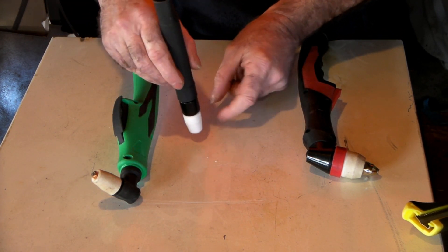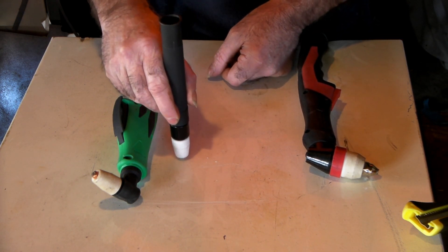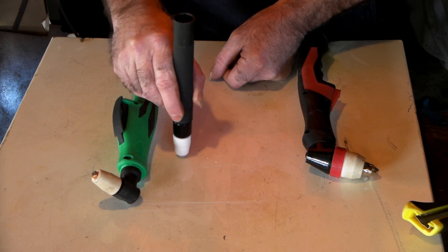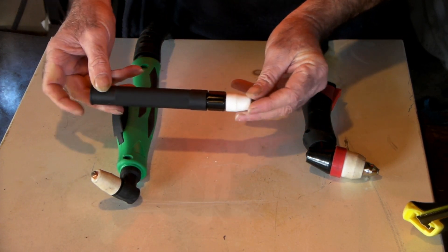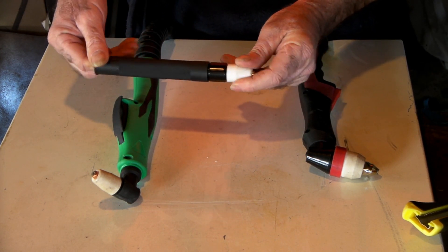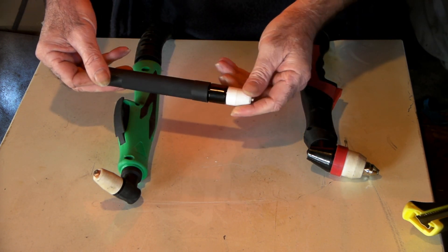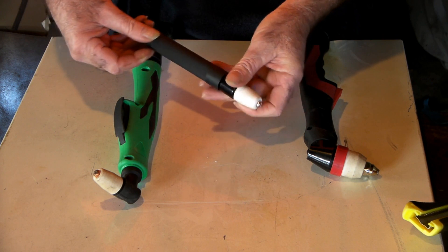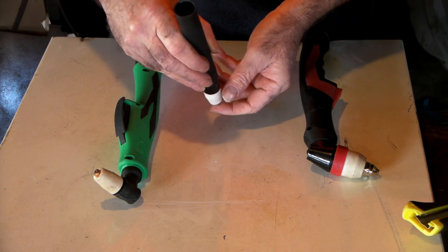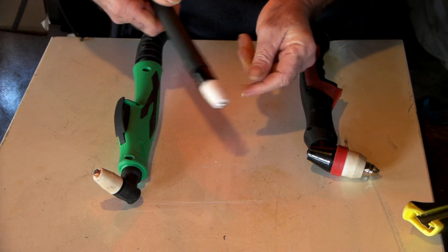This is a lot easier to mount on your machine. It uses the cheap consumables. The only thing with this is it's a touch torch — not pilot arc. So it actually has to touch your metal. I don't know if that makes a big difference, but you can't get these in pilot arc, probably because they have low amperage. There's about 40 amps maximum you can run on this sort of torch. So what I'll do later in the video is I'll fire up this torch and show you how it works. Even if you want to use this by hand, it's quite a good little torch.